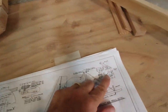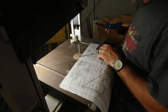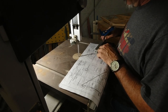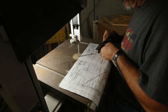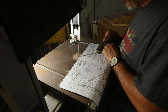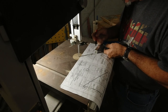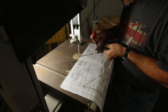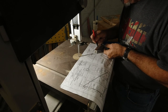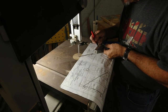Okay, let's make some brackets that look like that. They are an inch and a quarter long — this is three-quarter channel. The first thing I'll do is cut four of these at an inch and a quarter, then once that's set up we can measure for where the holes are going to be located, center-punch those, and just go through the normal process.